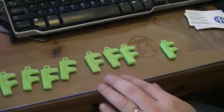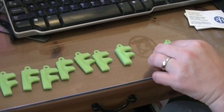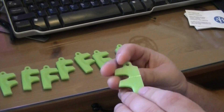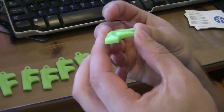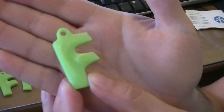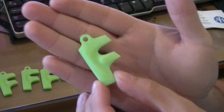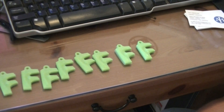That's something PLA is known for. Switching to blue painter's tape I got really good adhesion. I had the bed dialed in so my heights were good and I wasn't getting all that funky pushout at the bottom. A 0.2 layer height at 40 millimeters per second was fine — I have 'depth of cut' stuck in my head from machining.